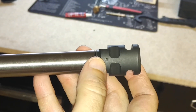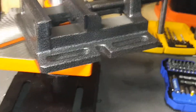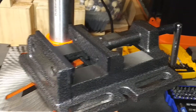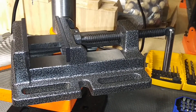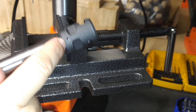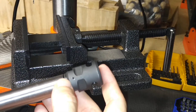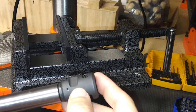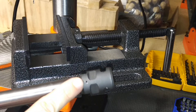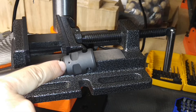We don't want to put the pin in there yet. We're going to have to go back over to the drill press. In order to make this permanently affixed so that it can't come back off, we have to bring that drill bit down and drill right through there and onto the threads of the barrel itself. We want to drill through the threads just a tiny little bit — it's going to mar up the threads enough so that our pin will fit in there, and the muzzle device isn't going to be able to back out ever again because we're going to completely destroy the threads on the inside. The pin will seat itself into the threads of the barrel as well as through the muzzle device.